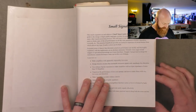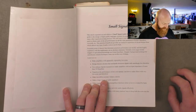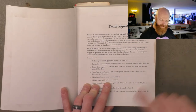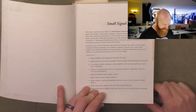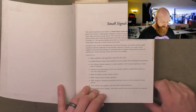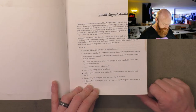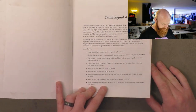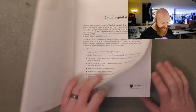Transform the performance of low-cost op-amps, make filters with very low noise and distortion, make incredibly accurate volume controls — someone was asking about that one — make a huge variety of audio equalizers, make magnetic cartridge preamplifiers with noise so low it's limited by basic physics, and switch, clip, compress and route audio signals effectively. Build reliable power supplies with many practical ways to keep both noise and cost down.